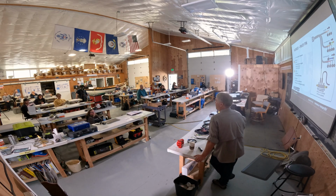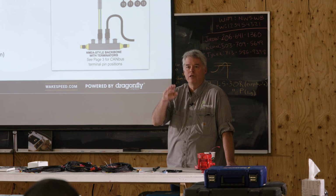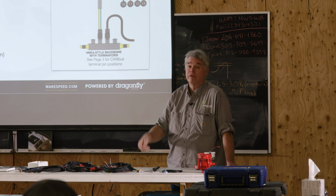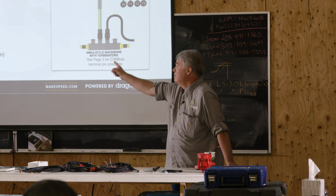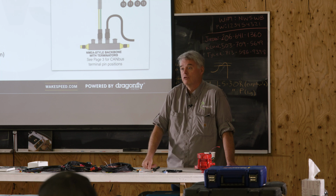It's very problematic when the alternator doesn't have to produce energy to the battery, your tach goes away. In the lead acid world, we had this feature where instead of going to 0, you'd go to like 2 or 3%, and that worked because lead acid batteries are forgiving. They just boil off more water. In the lithium world, that's dangerous. This, I think, is one of the most problematic aspects of doing system installs.